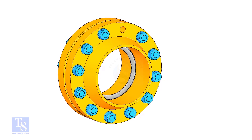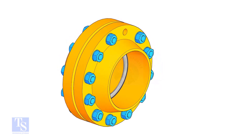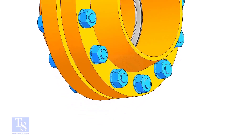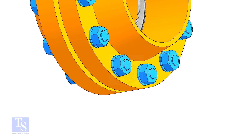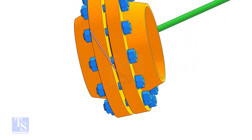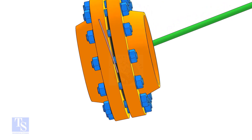Use a lever bar to align the holes and the outer face of the flanges. Now lift the gasket to its position — you can use a piece of a welding rod. Tighten the bolts only enough to hold the gasket in its correct location.